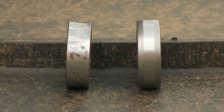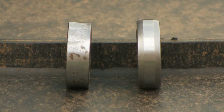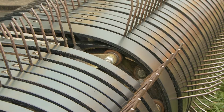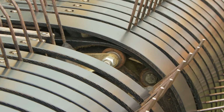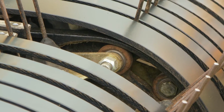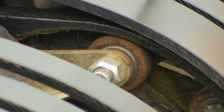One of your first maintenance items on your pickup head is the cam follower bearings. These are the bearings that run in the cam track. You will notice it is time to replace these when the outer race no longer has a domed edge and becomes flat and sharp. Here are the cam follower bearings. They are located on the inside track of each cam and the center of each head. You can clearly see the outer race of each bearing and when it is necessary to replace them.